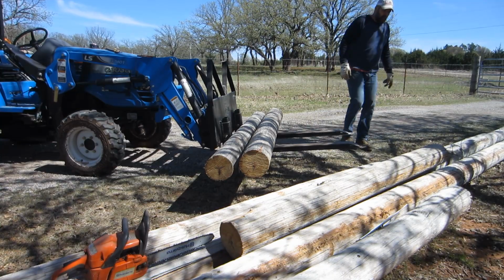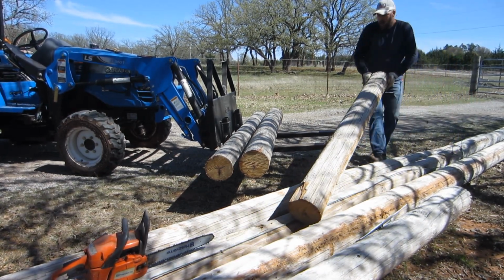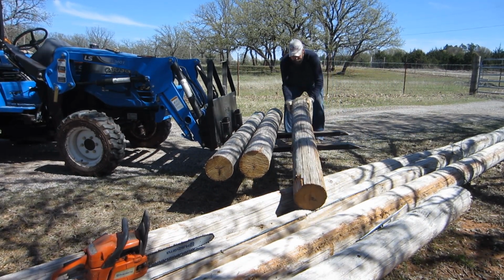I got the 12-inch auger bit because I knew I had telephone poles before I bought it, and they come in 6 inches, 9 inches, and 12 inches for the diameters of these auger bits, and I didn't want to have to dig a hole and then make it bigger. And since I'm tamping everything, I'm not using concrete for this. The hole goes down 3 feet, so I've been cutting all the lengths of pole about 7.5, which leaves me 4.5, 5 feet above ground.